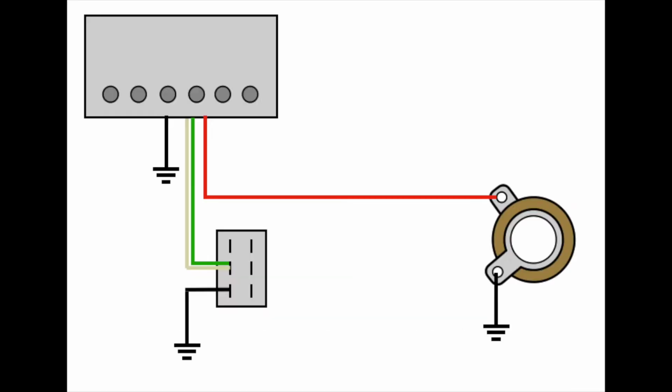So you can see here that if it's sent to the one above, it's not connected to anything. So it's just the same as if the green and white wires were connected together and taped off. So you'll be in a humbucker mode. If you connect it to the lug below, the signal from that coil will be sent to ground, never to be heard again. And you'll be left with just the remaining coil, which is sent down the live wire to your amp, which is the signal that you hear.